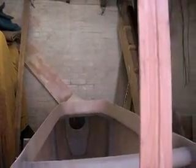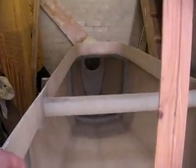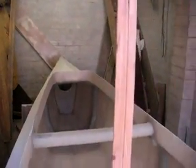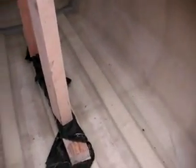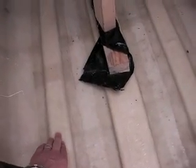I weighed the mass of the hull some time back before we put all these extra bits in, and it weighed about 70 pounds. What we are doing to increase the stiffness of the hull is to put these in, which is polyurethane foam, expanded foam, and we're just sheathing it with fiberglass. It's a 4-inch wide piece, 3/4 of an inch high. This is a 2.5 inch by a 1/2 inch high. This is just to add some longitudinal stiffness.